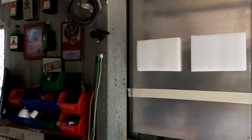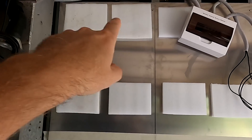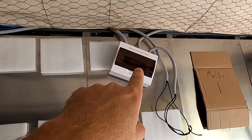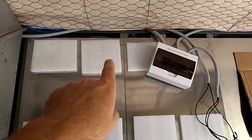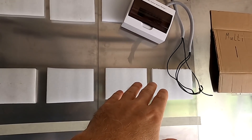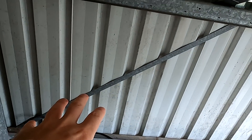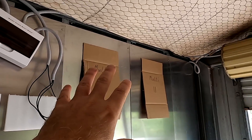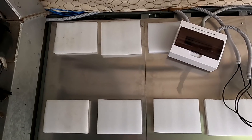There was a comment under one of the videos suggesting having the charge controllers all next to each other rather than on top of each other, and having the switchboards or combiner boxes all up there. Then you've got a clear direction: incoming solar, conversion to DC, MPPT solar charge controllers, battery, inverters, AC. That makes a lot more sense.